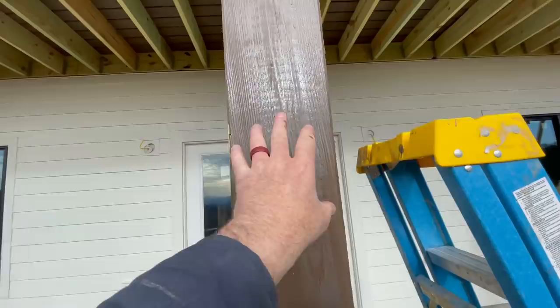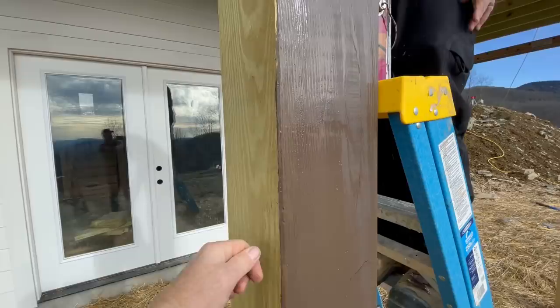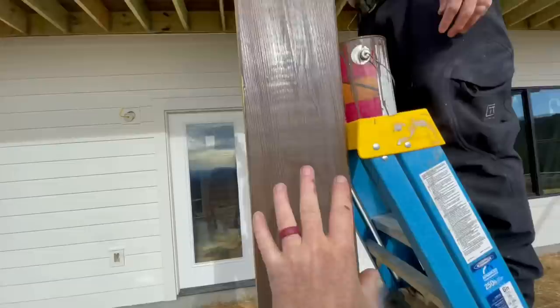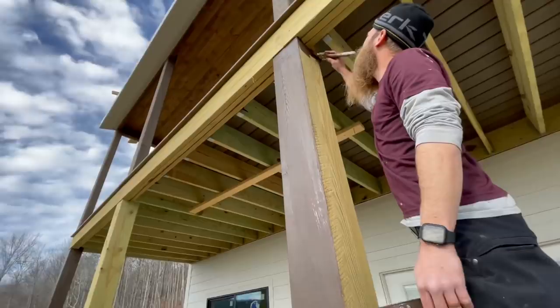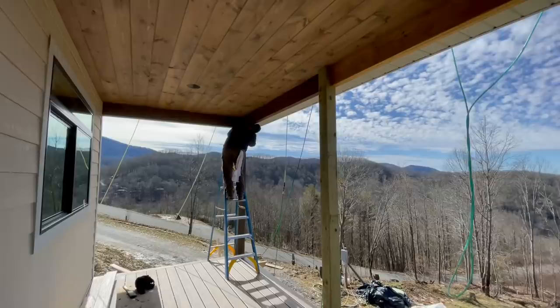Staining — we're very meticulous. We'll do one face and try not to lap onto another face, because if you did, some of the stain would soak in and when you coated that face again it would look double dark. So we do one face at a time and keep a wet edge — that means we don't stop or walk away until it's done all the way down, then swap to the next face. That's a good way to make it look good in the finish.